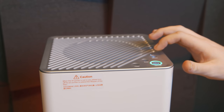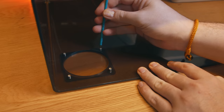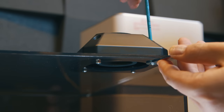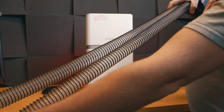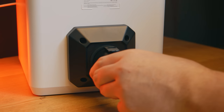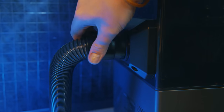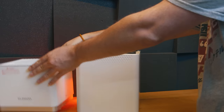There's also an auto mode, which should adjust the fan speed dynamically, but when I had this enabled, the speed never shifted from its very slow operation. Getting this connected to your printer is really straightforward using the tools you've got with the printer. You can just remove the vent hole cover and install the hose mount that comes with the Mate — it's just four bolts and it's on. It's nice and simple. The devices are linked together using the connector hose, similar to the type of flexible hoses that you'll get on a vacuum cleaner. This'll stretch up to three meters in length. Both ends are compression fit into both the printer mount and the matching mount on the Mars Mate — not too tight, everything held in place with a large rubber gasket. Keeping the hose installed at all times does make the printer lids quite unwieldy, so it's a good idea to disconnect it before shifting the lid about. It's all been quite well thought out for a simple installation, connection, and accessibility.